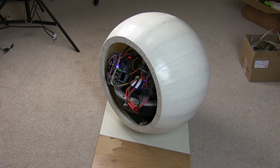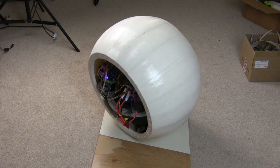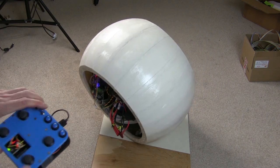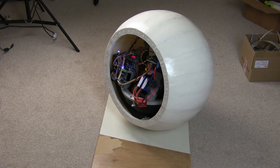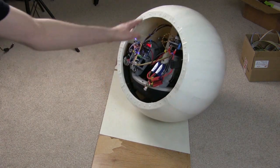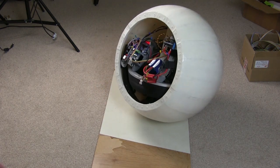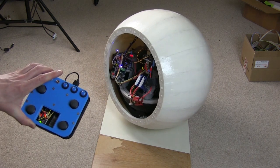I've now tuned up those PID controllers — one controls what angle it moves to, the other controls how fast it gets there. I can tune them to be more or less aggressive by altering the P, I, and D values in each PID controller. Now let's compare unstabilized and stabilized. With the enable pin off I'll give this a shove — as expected it rocks backwards and forwards for quite some time on a smooth board. Now if I give it a rock and turn on the enable pin, we should find it stabilizes pretty quickly. I'm overcompensating a little bit so sometimes it gets stuck — I probably need to undercompensate so it always returns to the middle — but nonetheless the principle of stabilization is there and it works pretty well.